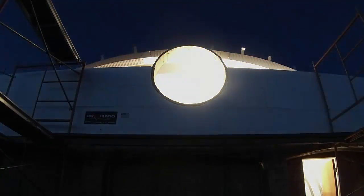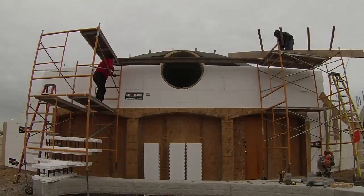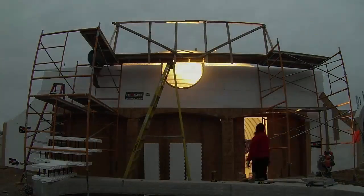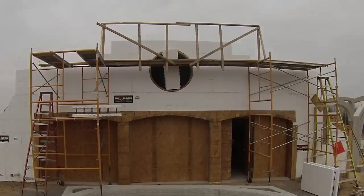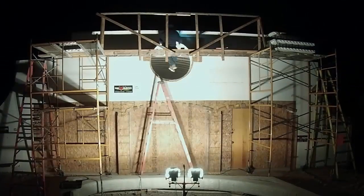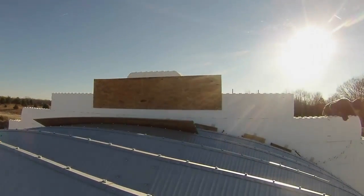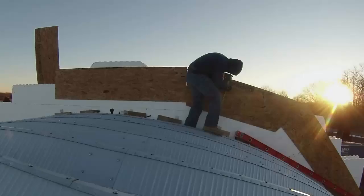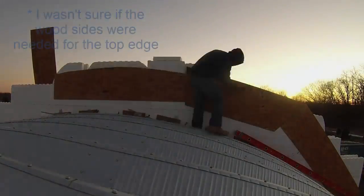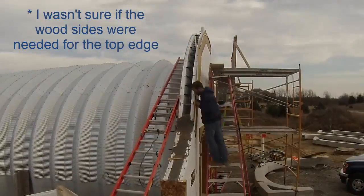Then it was time to raise the scaffold deck to another level. The scaffold was the same width as before, but at this height it felt much narrower, so I decided to widen it and add a rail — that felt much better, even if I didn't get many blocks up that afternoon. Another afternoon and we were able to get the remaining layers of Fox Blocks and rebar up. Then vertical rebar needed to go in. For this final trim, I used a 1-inch wide strip of rigid insulation to help form that smooth curve through my coordinates. This curve-trimming part was probably the most annoying part of the whole build — it felt slow and tedious and I wasn't even 100% sure it was necessary.